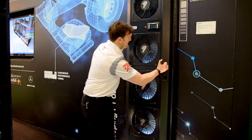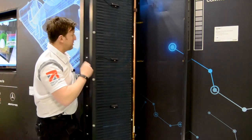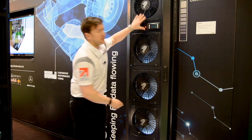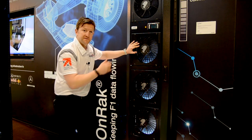What you have here, if I open up the door, everything that you need is within the door itself. This will mate with any rack manufacturer. As I open the door, the four EC fans automatically ramp up to 100%, so you've got no loss of duty. You've got maximum airflow over that coil.